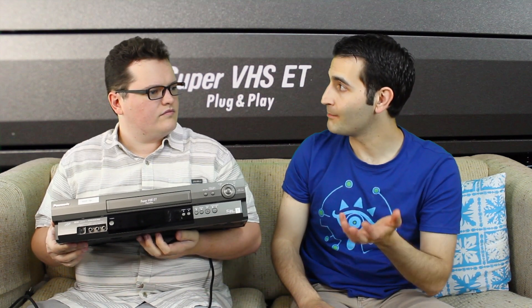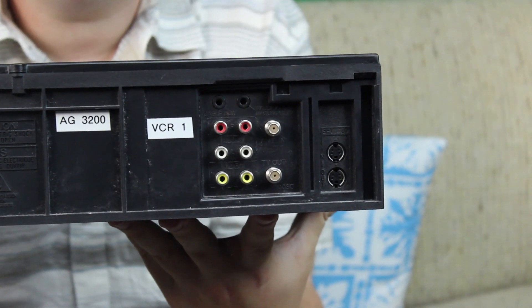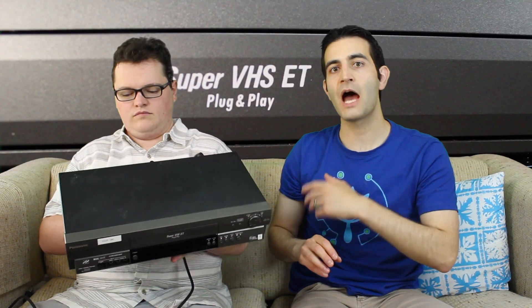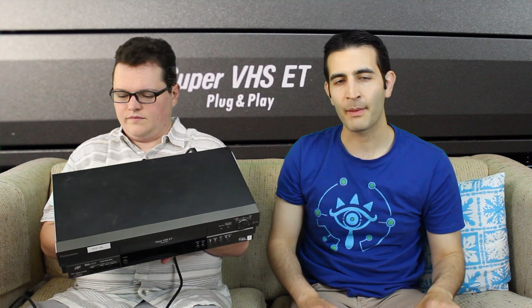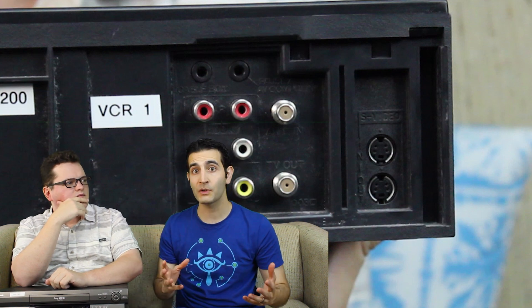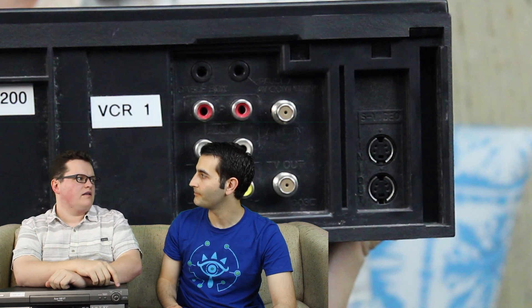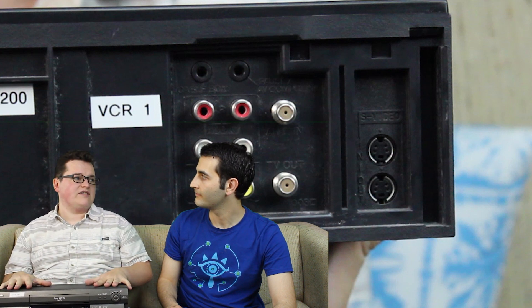To give it a little bit of context compared to the Pikachu VCR: that one has RF and composite out, while this has S-video out. So you have chrominance and luminance separated — because it's S-video, you get a better quality image. I've been looking for these Super VHS players and couldn't find one thrifting — it's shocking how few and far between they are. They didn't have much of a shelf life because there was a very small timeframe when these were actually sold. It was never really adopted on a consumer level, and the people who would have had them were the first adopters of DVD.